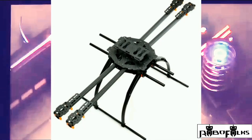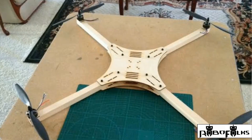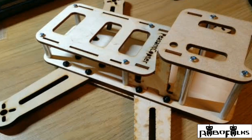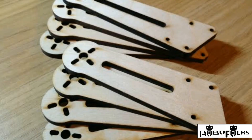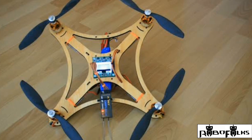Wood is another option for building a frame. It is fast, low cost, and does not require too much effort, though it is not nearly as stylish as a carbon fiber or fiberglass drone. Wood is a very good material for this sort of thing — it is RF transparent, handles brief structural overloads well, works with simple adhesives, and dampens vibration wonderfully.